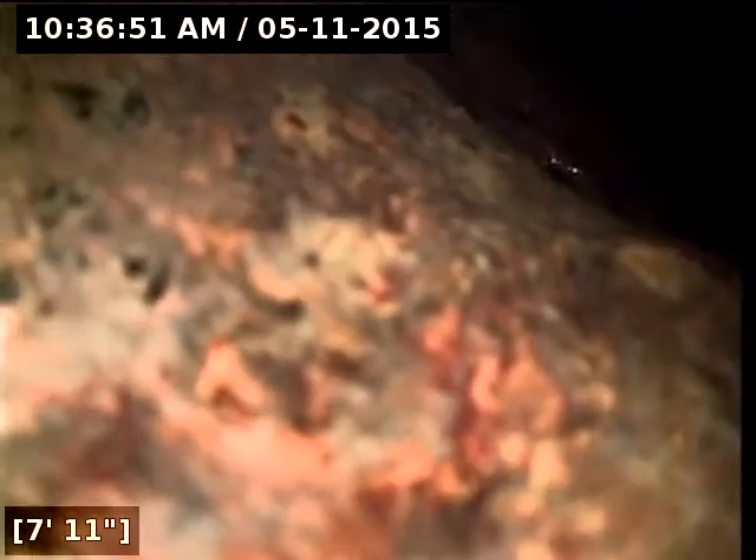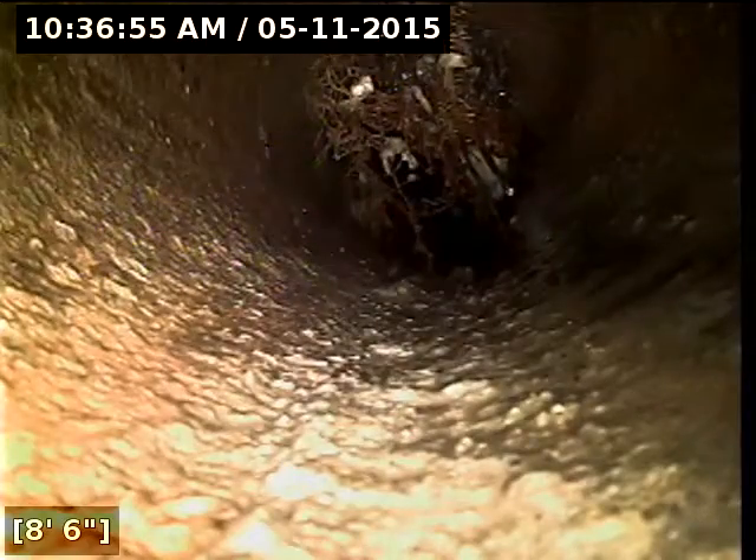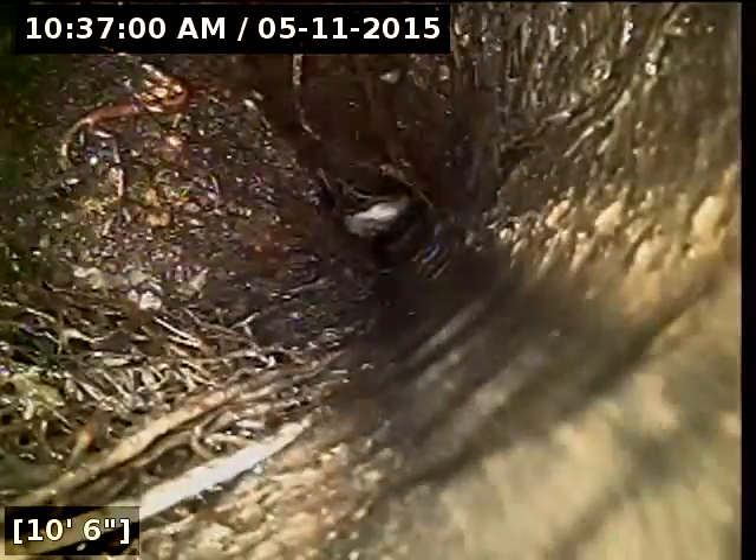Here at eight feet from the point of access, roughly, is where it transitions from the three-inch cast iron to what looks like six-inch concrete pipe. Just beyond that you can see there are some very large root intrusions that come through the top of the pipe and down, probably through the joints, but it's totally engulfed the sewer pipe. I'm going to recommend some repair work. It looks like the roots are just growing down the sewer line — I'm going to reel back to see where they come in at.